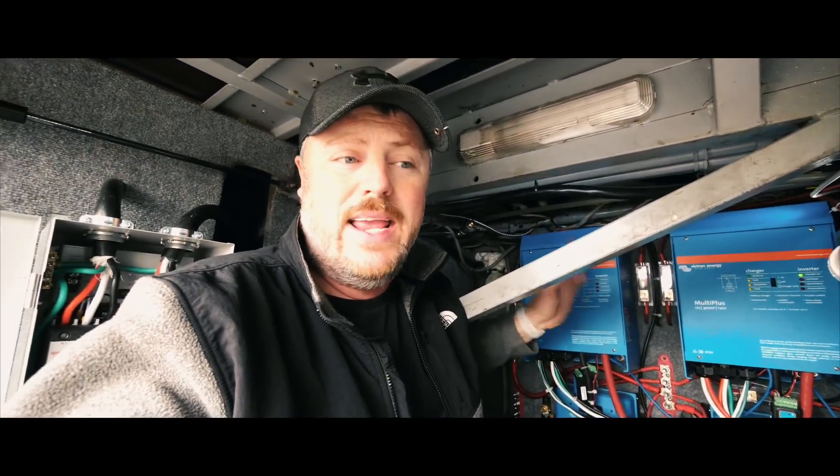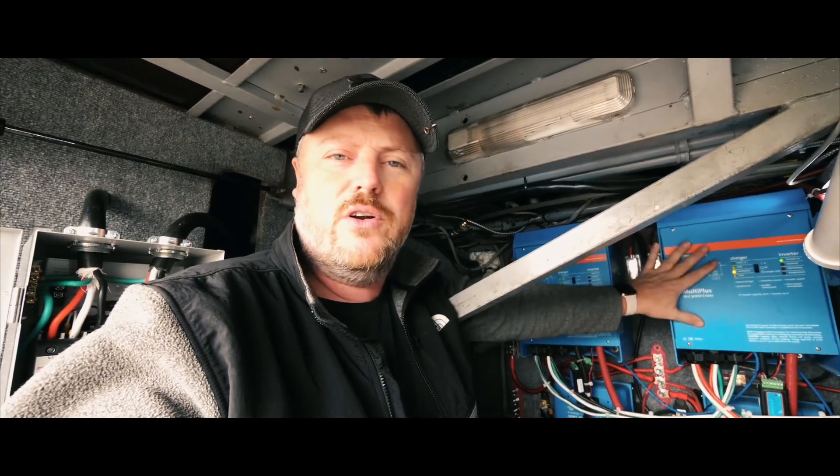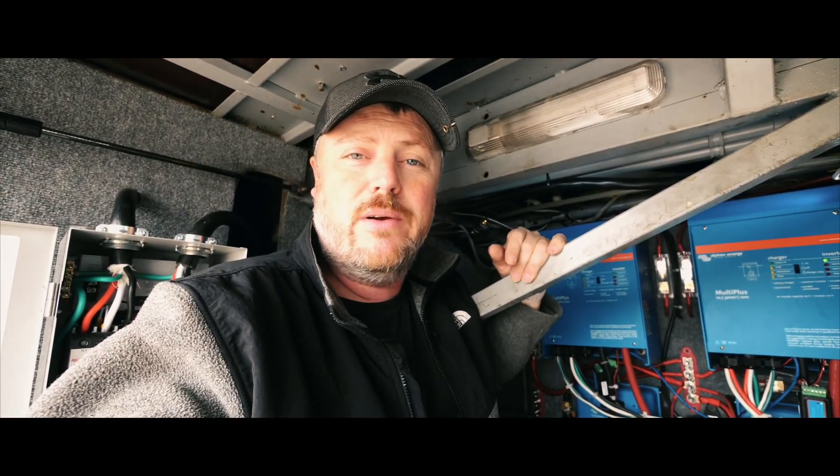So if I want to run my heater solely on my generator, I can start my generator and everything works together as it should. It's a little hack you can use — I didn't want to have to buy a 220 generator, and it works great. The only downside to doing it this way is you can't utilize both inverters as your charger, you can only use one. If you want to connect your system like this and still use a smaller generator, it is possible — the generator's main purpose in this setup is charging your batteries.